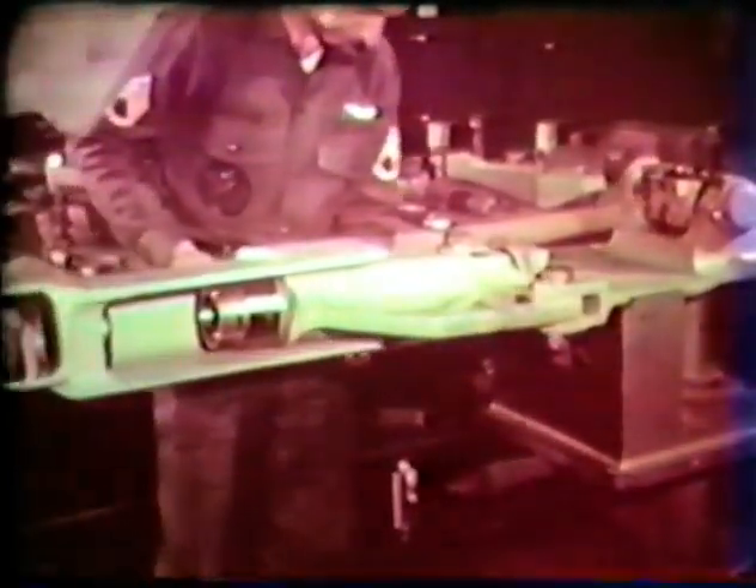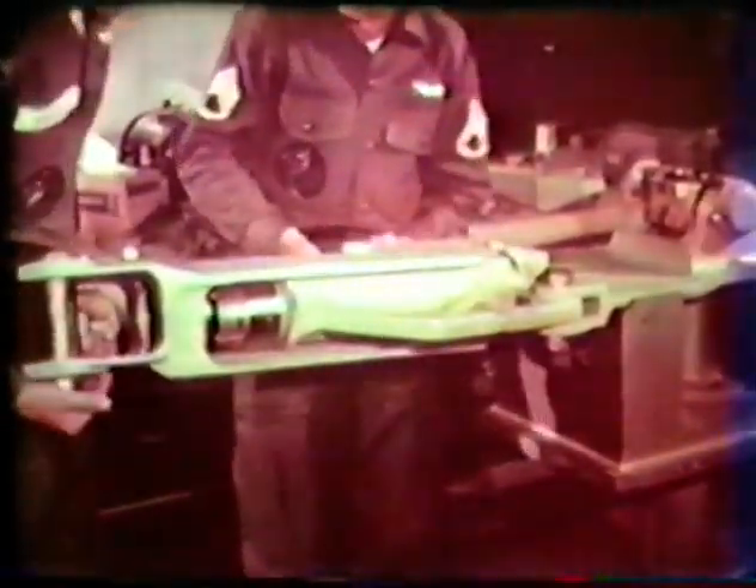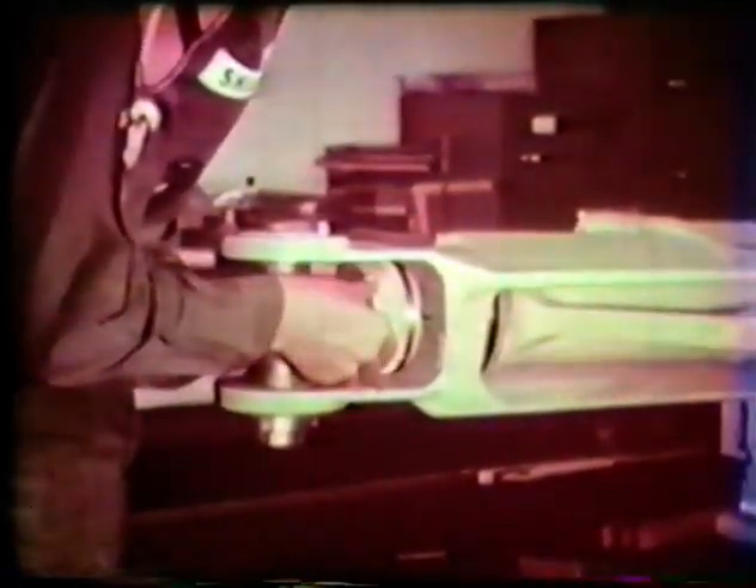One small but important detail during reassembly is the adjustment of outboard grip bearing seals. AH-1G main rotor heads incorporate a new type radius ring employing a bonded plastic shield. When adjusting this shielded ring, the gap should be set from 0.000 to 0.040 inches. If replacement of the ring with the shielded type is not possible, the older unshielded ring may be used; the gap for the unshielded ring should be set at 0.030 inches, with tolerance from 0.030 to 0.070 inches. When the older unshielded ring is used, the inspection interval is also reduced to 200 hours.